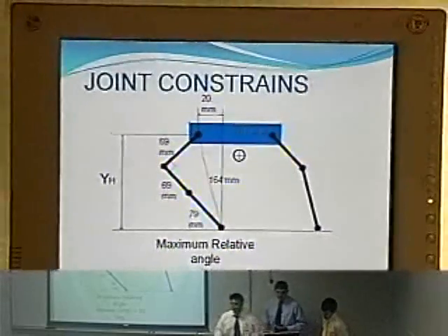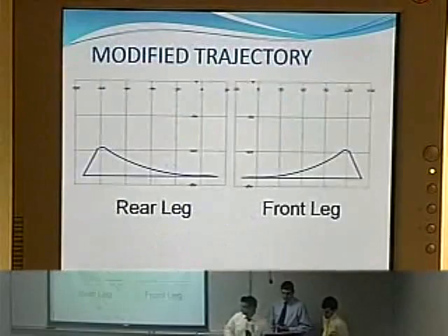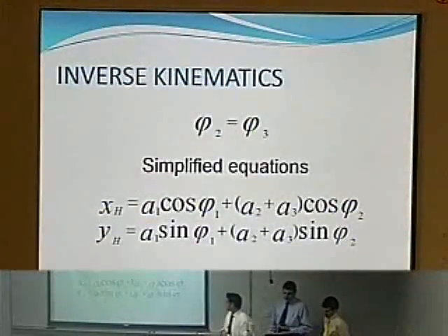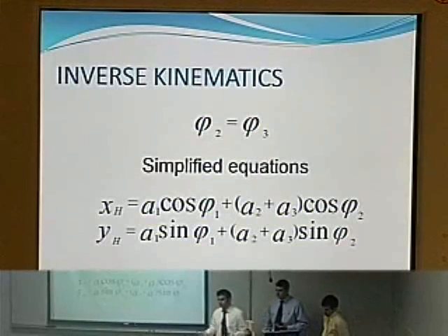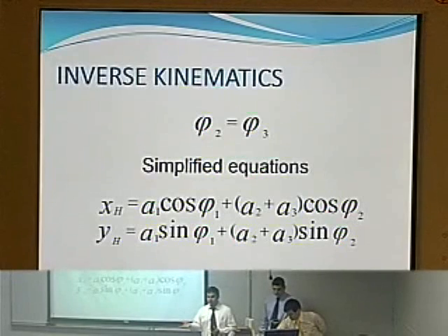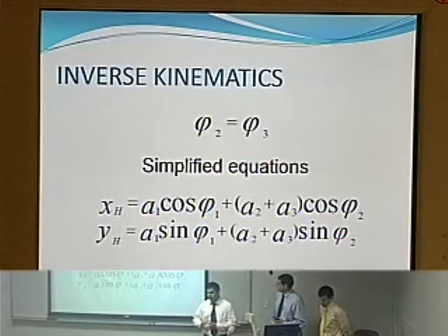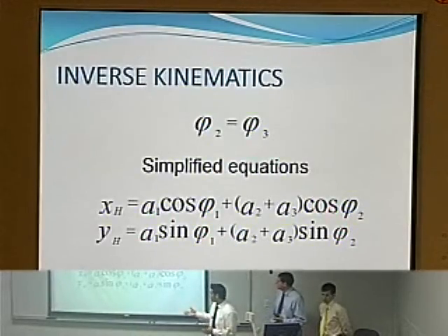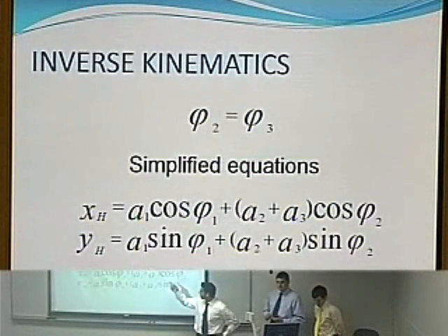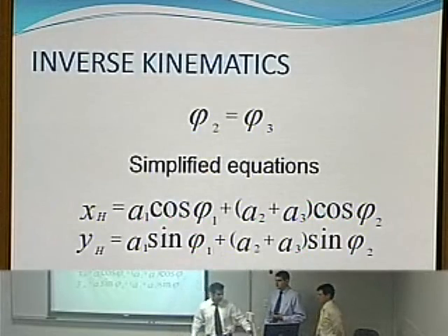Keeping that in mind, I redesigned the path to be followed for each one of the legs. This is the modified trajectory. To solve the kinematic equations again, I had an extra problem: each leg is a planar 3-degrees-of-freedom robotic arm, giving me three variables and only two equations. To make the system solvable, I specified one joint position at all times by setting theta 2 equal to theta 3, which simplified the equations and made them solvable.